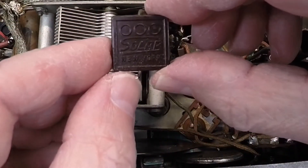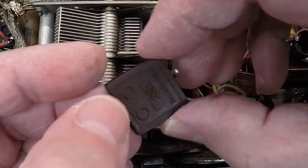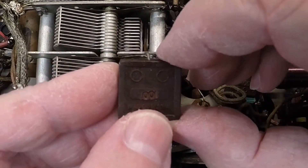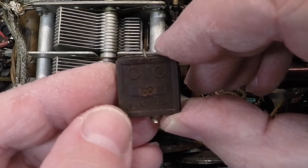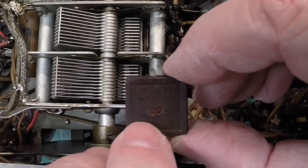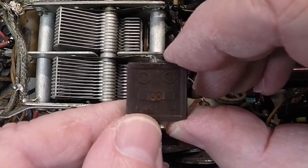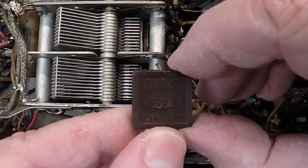Here's the capacitor again that's in question. This may not even be a mica capacitor — a lot of these that look like mica are nothing more than paper caps, so I may have to do some research on that. That may be the case right here. Let me go pull a schematic and check this out and confirm the value itself.